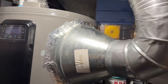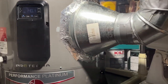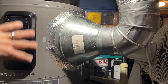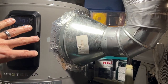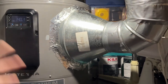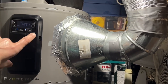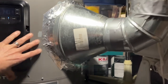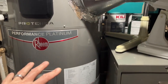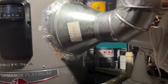When it reached 2 degrees Celsius, the compressor wouldn't turn on — it was too cold. Unlike heat pumps, this unit doesn't have a defrost cycle. In Canada, outside heat pumps are a waste of money anyway. The compressor just wouldn't start regardless of what I did. Even running the electric element, the system was so well insulated that the compressor still didn't get warm enough.